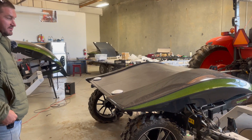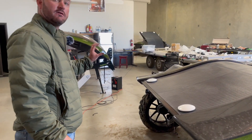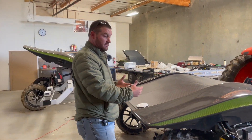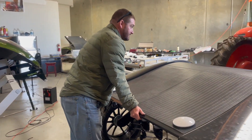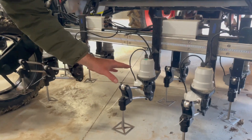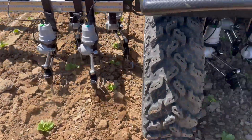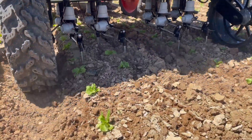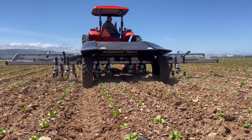You can look at these heads — these are sold and production-ready. On the other models, the heads are a little smaller, and what we noticed is that the smaller heads and motors don't penetrate the ground as well, so Don has upgraded those to the brand new heads. We have a larger motor on top and a larger motor on the side. We also have different blade sizes — this is our medium-sized cutter. We have every different type of blade you can imagine; we don't even know which ones are best yet for different crops depending on plant-to-plant spacing, but we can build any blade possible — square, triangle, or circle — to adapt to any situation.